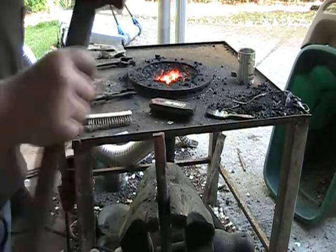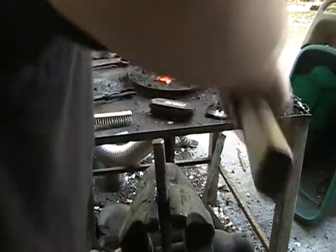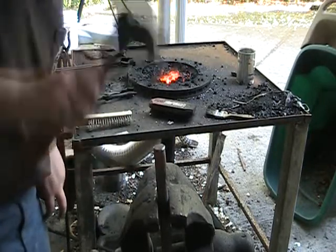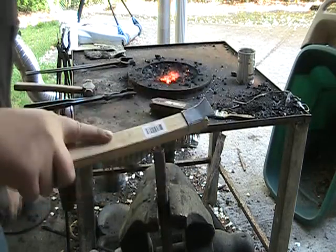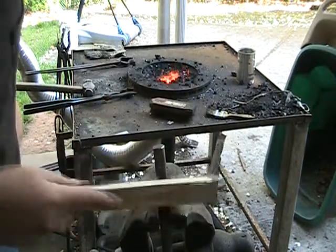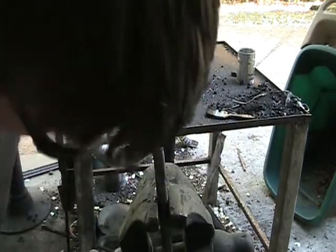So I just got a slight heat, and I go around the edges and hit glancing strikes with my hammer just to kind of pull the edges down. Then I'll brush it and get the angle grinder and grind a lot of this stuff off.